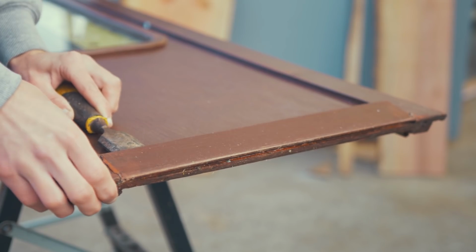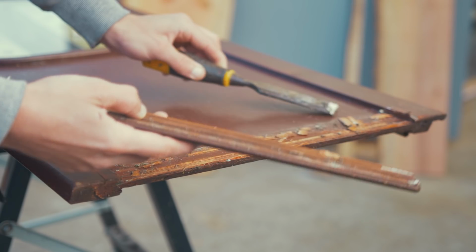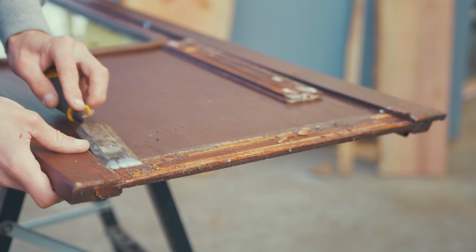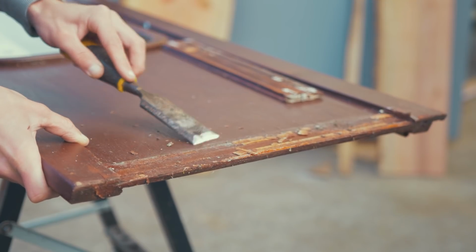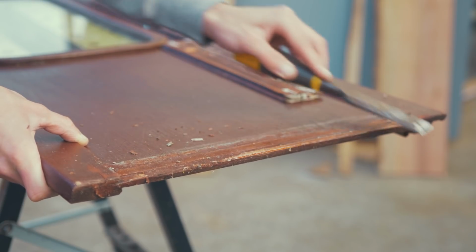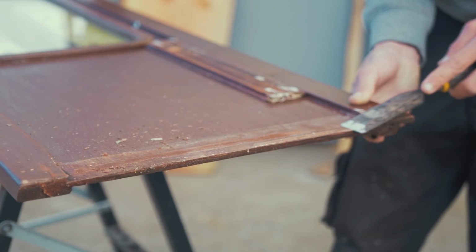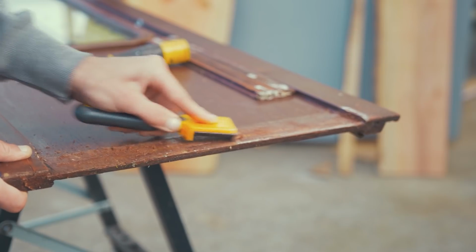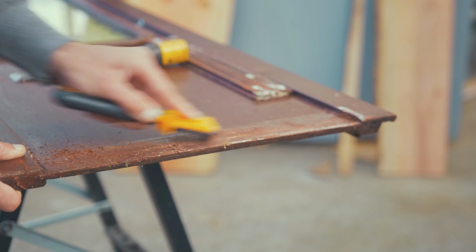So the hardwood teak strips on the two sliding doors at the wheelhouse cabin entrance, I'm reattaching these. I want to make sure they're secured. I wasn't happy with the way I'd done them before, and they just weren't going to be long lasting and as strong as they could have been. So I'm reattaching them. I'm going to use Cascamite and make sure the mix is done properly, and then also we'll treat any soft, punky wood with wood hardener, and yeah, that's pretty much that.